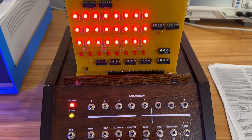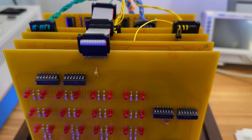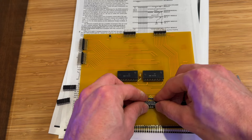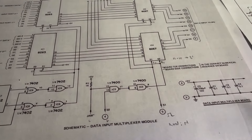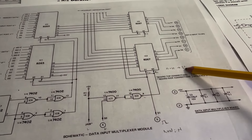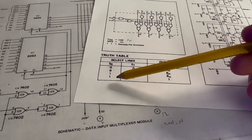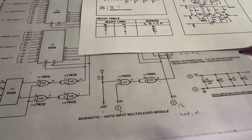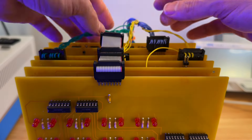Still no luck with the new microprocessor. The next thing we can try is to swap out the 8266 multiplexer with the 8267 specified in the original documentation. Initially I did not think there would be many differences between these two multiplexers, but having done some probing and scoping, it seems like the signal for the LEDs on the LED register board is coming from the input multiplexer board and they are all ones. Looking at the truth table for the multiplexer, to get all ones both select lines have to be ones as well, but based on my scopes the select lines do not appear to be all ones — so there seems to be an issue with these multiplexers. Let's install the 8267 multiplexers and try the program again.